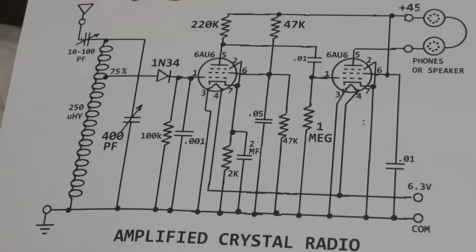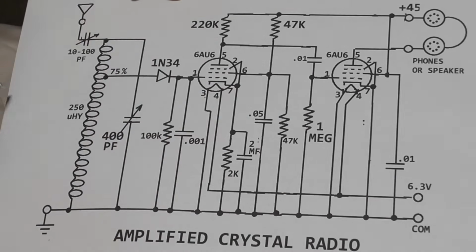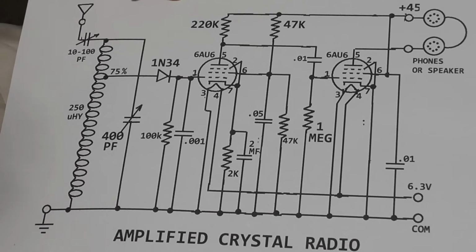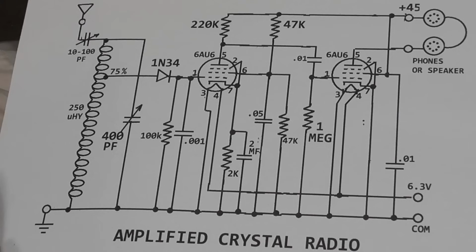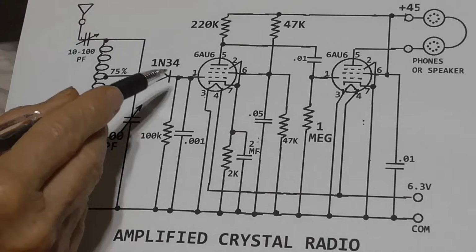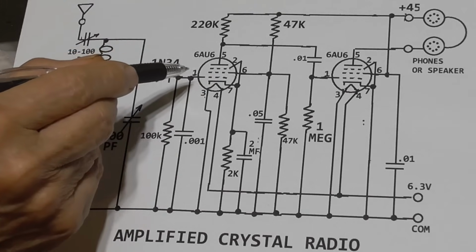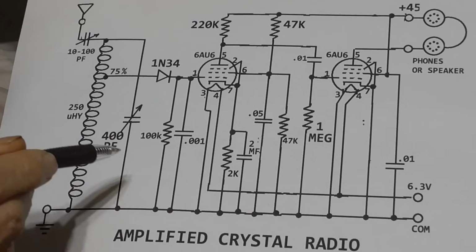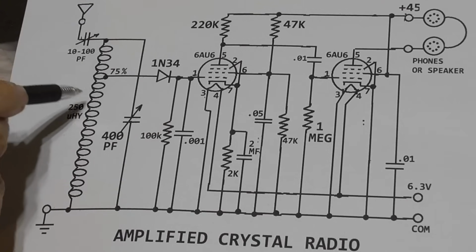We don't want to adjust the volume by simply using a volume control in the amplifier, because what we want is to have the highest Q possible in our tuned circuit so that we can separate stations when we have a really loud signal. When we have a lot of loud signals, we're generating volts at this point here. We may generate 1 to 2 volts here, putting it in the amplifier and just saturate it. And we'd have to put a volume control here to load down or cut the signal down. But that would still keep the Q very low here.